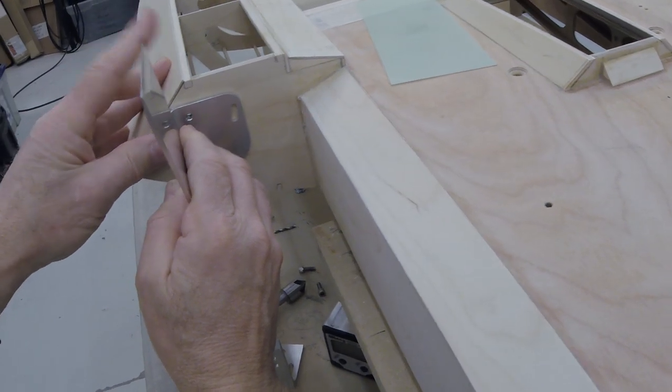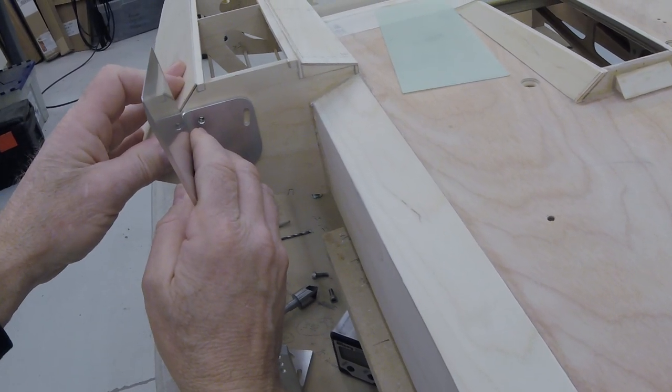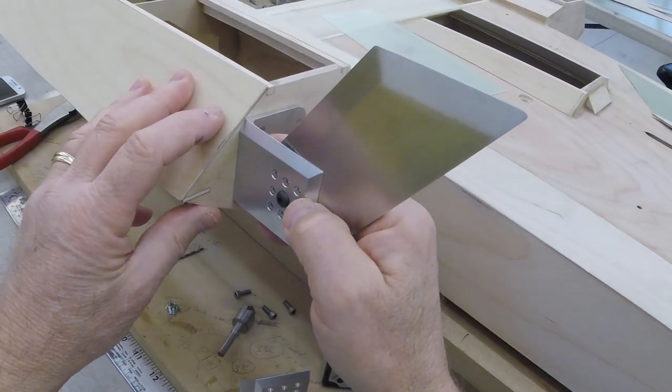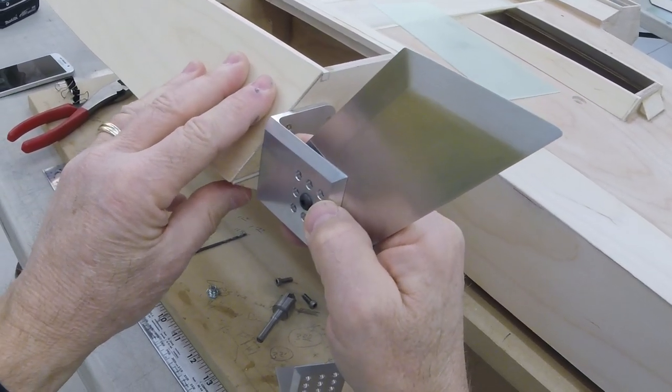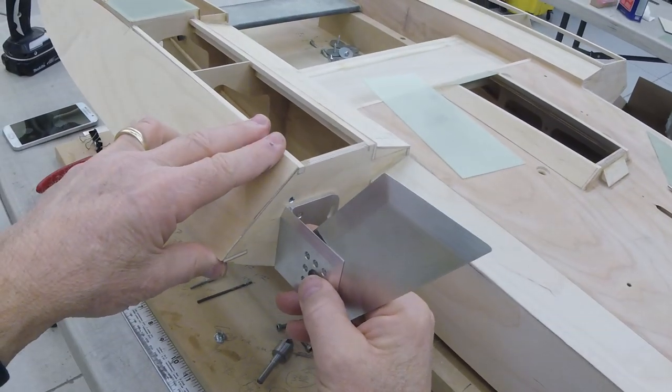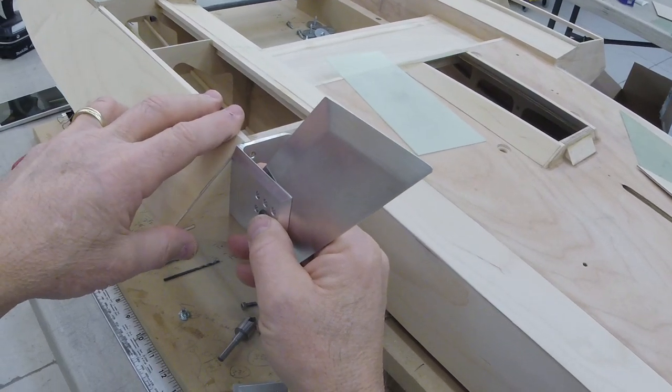You'll see it's a little bit outboard of the ride pad. Hopefully you can see that. And I like that a lot. This is my compromise position, okay? I want a certain size bracket, so I can't go out here. I want it out wide and I want it as low on the sponson transom as I can get it.